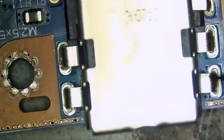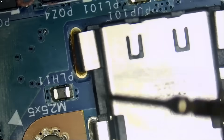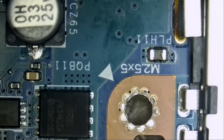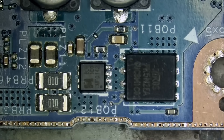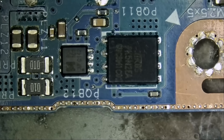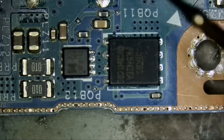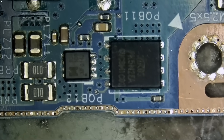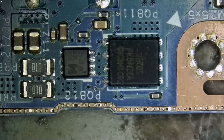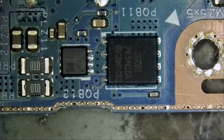The first thing I want to do is check the DC connector right here. Next to it, we should have two DC power MOSFETs — they could be on the left, right, bottom, or top depending on the laptop. For this laptop, we have a big one and a small one. I'm interested in the drain of the small one. How do you know? Because I work on laptops every day.